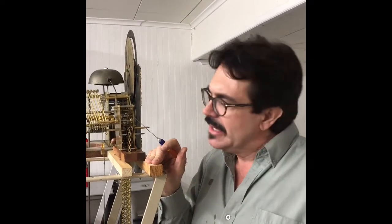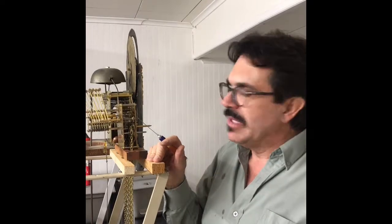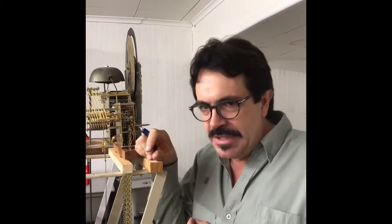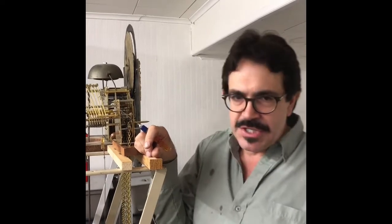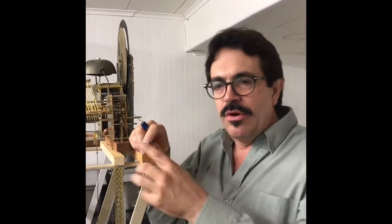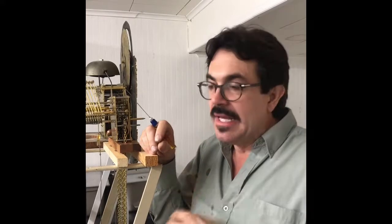And what happens is there's always an amount of dust created of brass. And the brass dust tends to accumulate at the bottom of the hole of the arbor. So if we were to oil every time, every year, every 6 months, for 12, 10 years before the next service, what happens when you oil, you recirculate the dust around the arbor or axle. It's not a good thing.